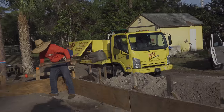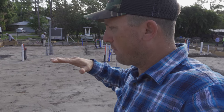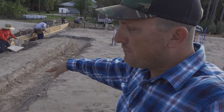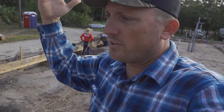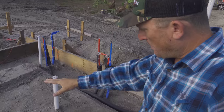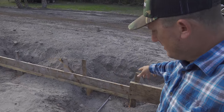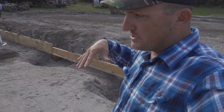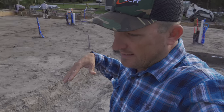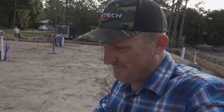What these guys are doing right now is key to making a good house - you've got to have a solid foundation. Everything has to be perfect. You can see these deep areas that they're digging; these are called footers, and that's where there will be more concrete to withstand the load of the house. This is the pad where my tub will be. We're going to have four columns out here - these deep footers are where the columns are going to go. Right now I'm standing in the back porch, and I can only imagine all the great times we're going to have as a family sitting out here, hanging out, coming up with new ideas.